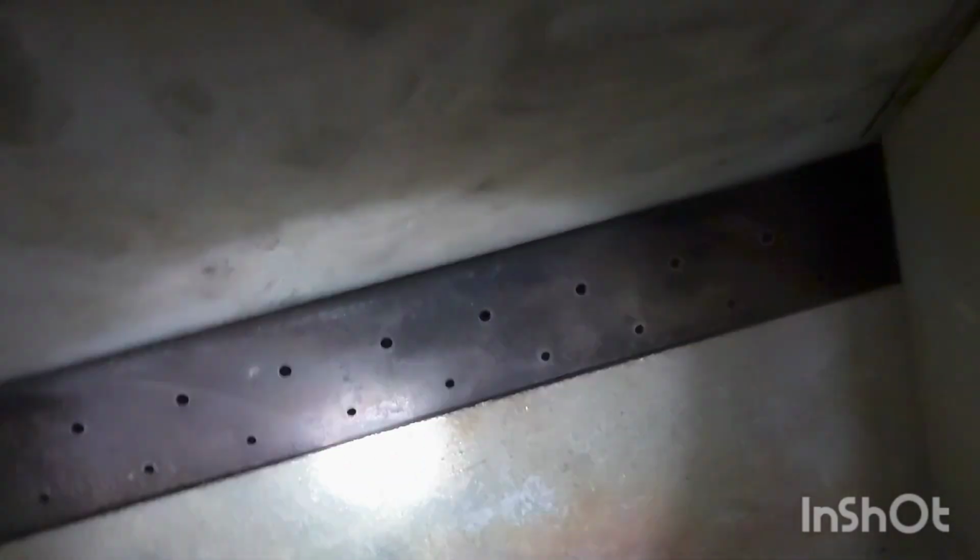But also keep hold of this top piece. Take this brick out, drop it down to one side, hold the top piece as well, and then once you've got that out, put it somewhere very safe. Don't put them on top of each other, and I said don't grab them at the ends. Always grab them in the middle, and just have a look at them and make sure that there's no hairline fractures or anything like that. It's always a good idea, if there is, to let the customer know immediately so that they're aware.